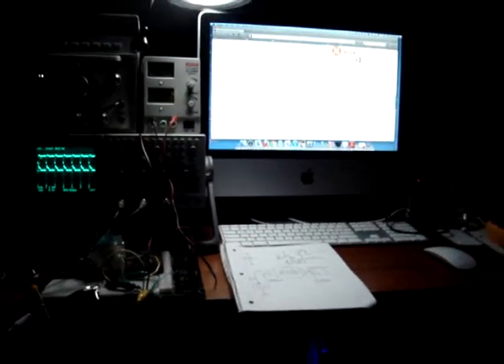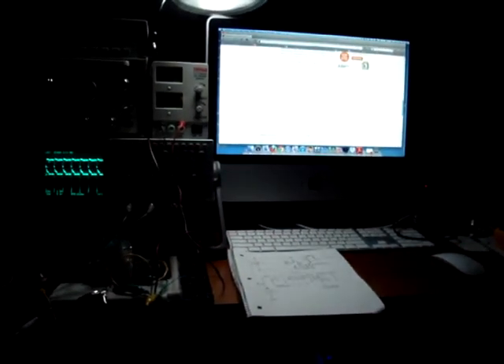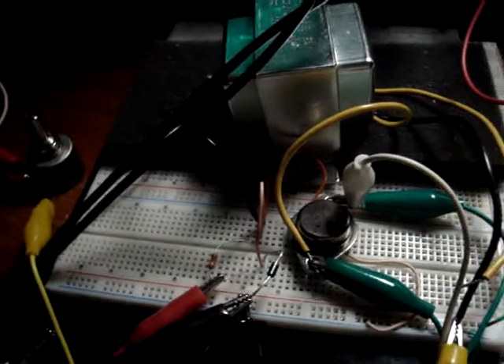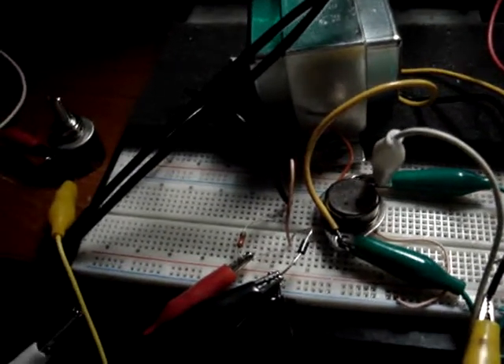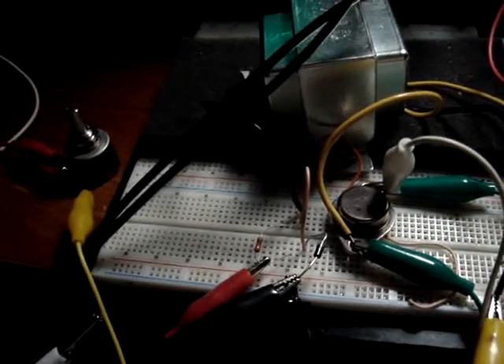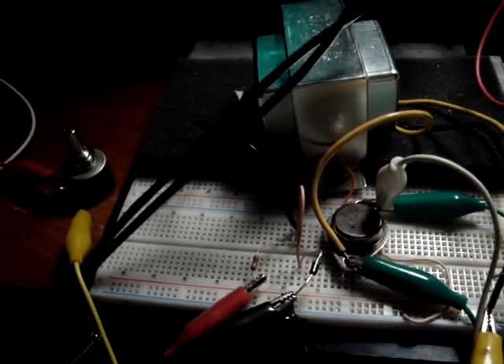Anyway, I just wanted to show you what you could do with this system. I'm low power and I'm having fun playing with it. Tomorrow — this circuit is really breadboarded and looks like a mess — I'll clean it up a whole bunch. I'll probably mount the transistor on top of the transformer with a couple of standoffs, just have everything hardwired right there with a fixed amount of resistance, and let it run.